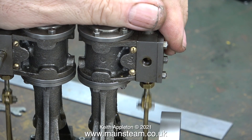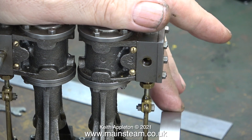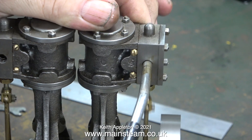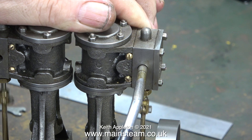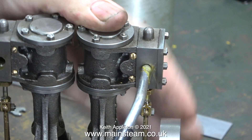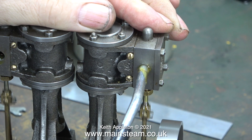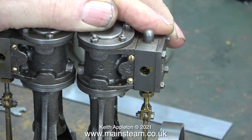That's why it's always a really good idea to time engines with individual cylinders. When the combination piping is attached to the inlet, you don't know which cylinder is better than the other. When I connect compressed air to the cylinder at the flywheel end, it definitely doesn't run as well. At the end of each stroke the air is blowing directly to exhaust. I can persuade it to run, but it's definitely not right. There are a few things wrong with this engine that I'm going to put right before I rebuild it into a suitable engine for this very high quality steam plant.